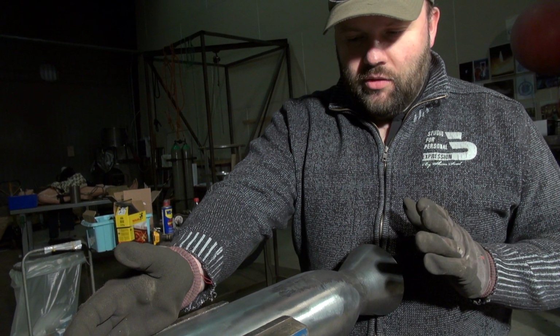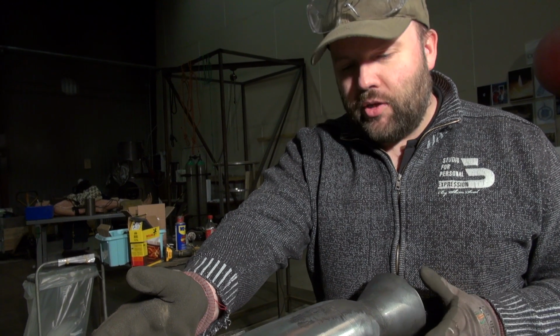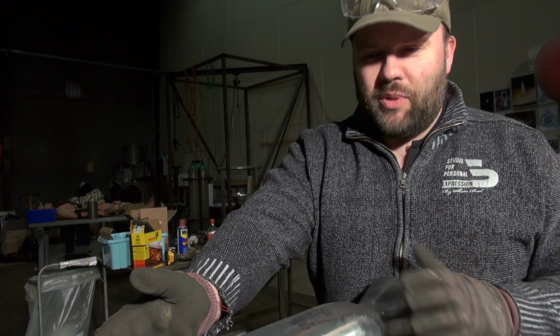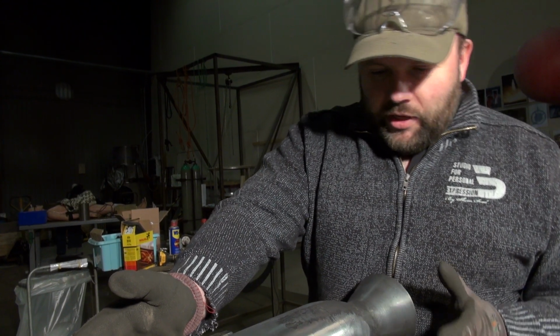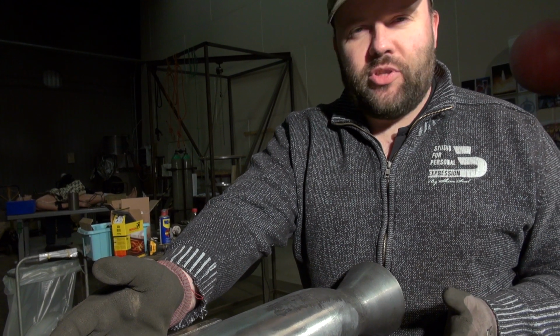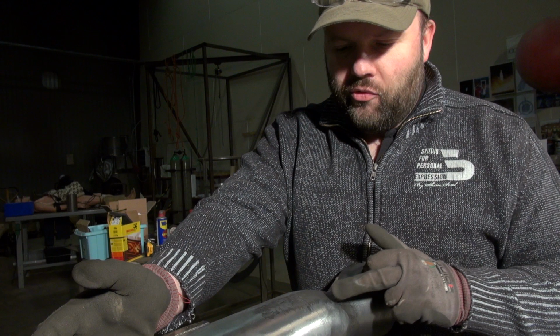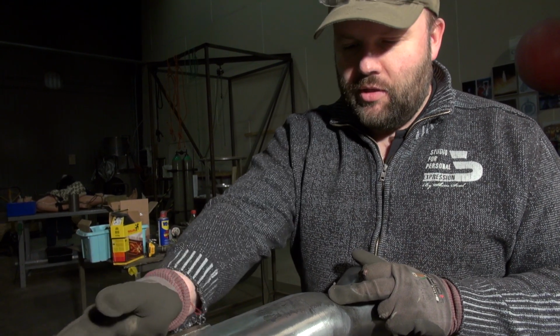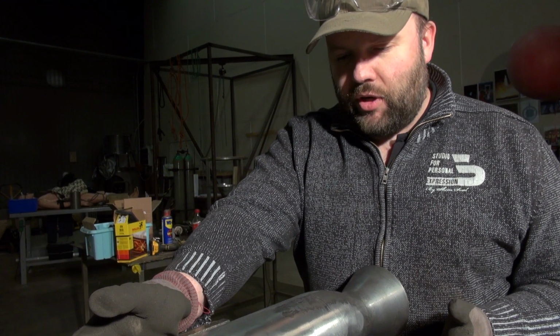It's one of the liners that received thermal tempering rather early on. So it's one of those that has been exposed to an incomplete inert atmosphere. What has turned out to be the case is that after the thermal tempering, there is a hard surface layer on top of the metal, which became exposed during the tempering process.